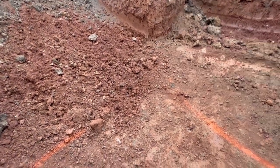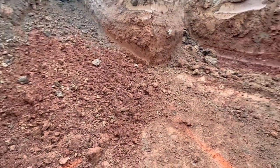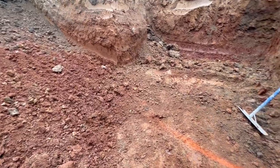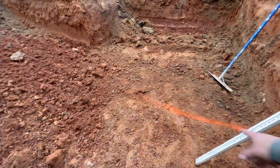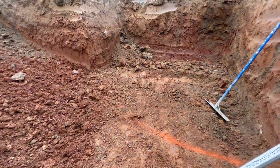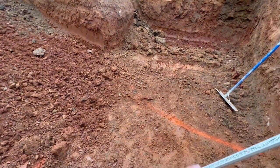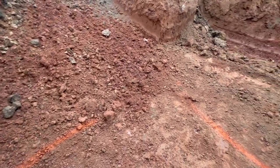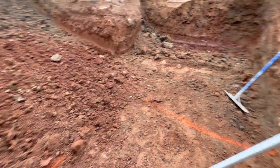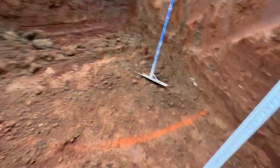And when we get done anyway, I'll put about an inch or so of rock and plate compact it really well. So either way, we're gonna get whatever's loose. But right here is the edge of my height. That line is good, everything else is high. And that's how I grade and use to, so he can tell where he has to dig out, where his line is. So it makes it so much easier to pinpoint all the breaks where it's high, where it's level here, and then it goes up. And that'll determine that.